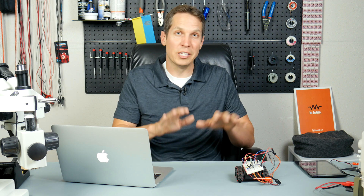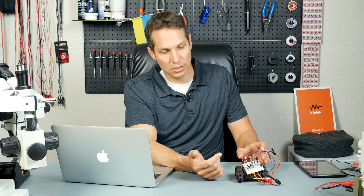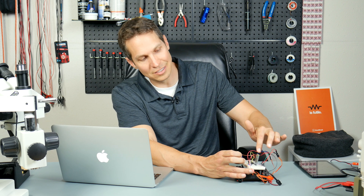In terms of the electronics, this is actually one of the more straightforward tutorials we'll have in a long time, because we're basically using the servo tutorial we've already gone over to drive these continuous rotation servos - it's the same concept. But instead of finding a specific point, they rotate continuously either forward or backwards depending on the pulse given them. We're also using the UART tutorial, because we are using the bit-banging UART we created to communicate with this HC-06 Bluetooth module.